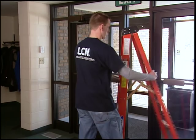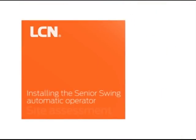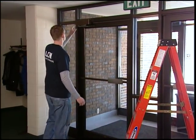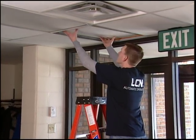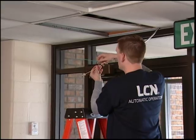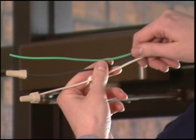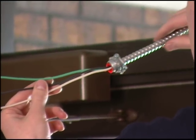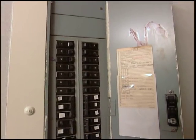We'll start the installation with a site assessment. Prior to ordering your Senior Swing Automatic Operator, and again just before installation, you need to review the location. First, check your power source. This automatic operator requires a 120 volt single-phase 60 Hertz fused 15 amp 3 wire power source. There should be approximately 12 inches of wire available to connect the operator. UL approved flexible conduit is recommended for the 120 volt power line.